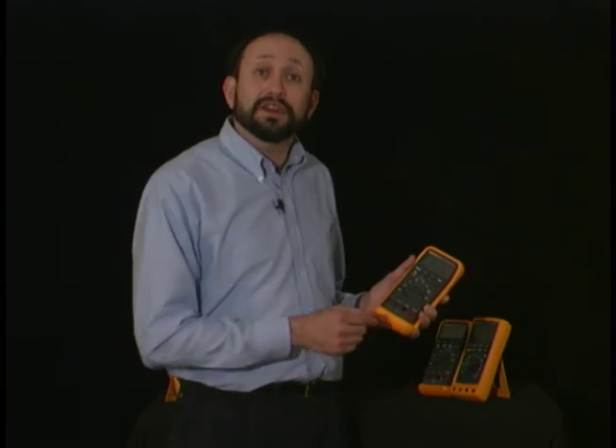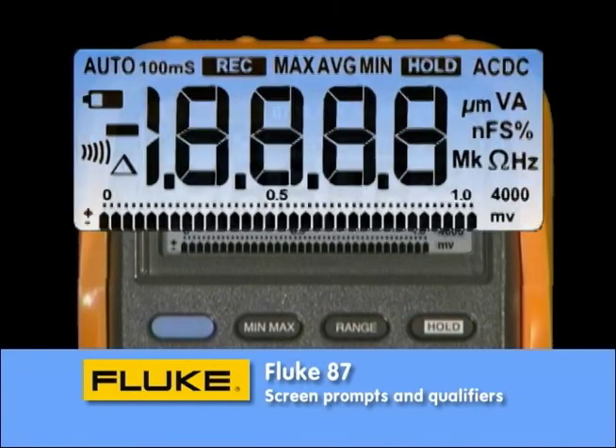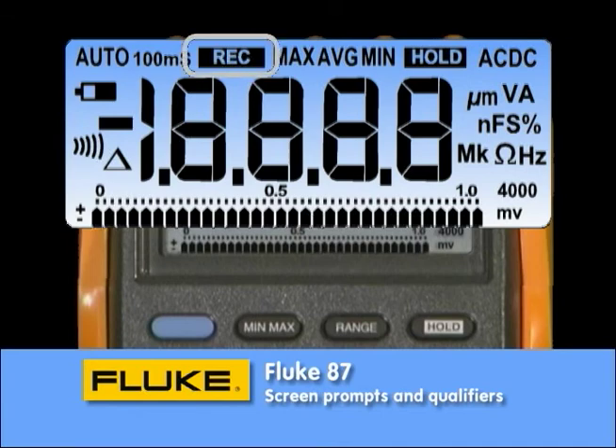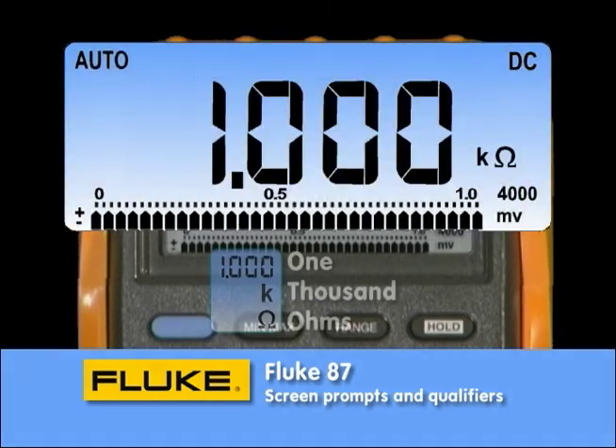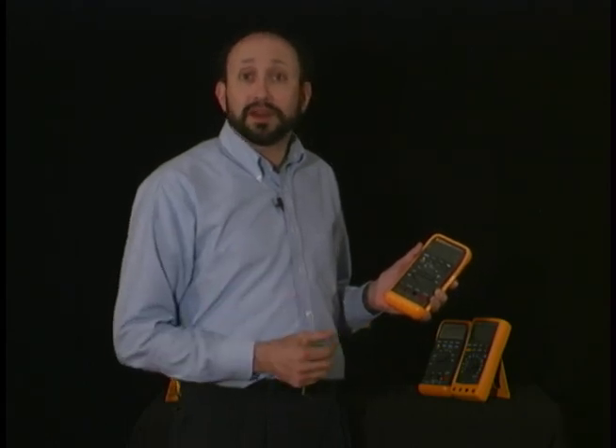Another thing to pay attention to are the different icons that appear around the display. They might indicate what mode you're in — for instance, data recording modes — or indicate a weak battery in need of replacement. Also important are the annunciators that appear to the right of the digital display. That can identify if a multiplier is involved; for instance, if there's a K after your reading, it might mean one thousand ohms or one thousand volts — you don't want to confuse that. Also count your decimal places: any time you see a decimal before the reading, it's less than one. Go to the manual, review it, make sure you're fully familiar. Then we'll go over to the simulator board and make some measurements.